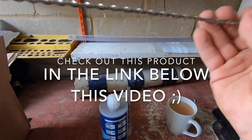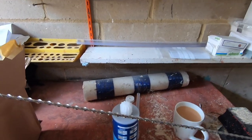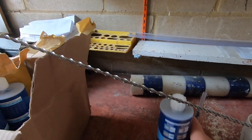The rods are flexible, which allows you to go around corners and work into any mortar joint. Where I've got the joint it's staggered and cracked a bit, which is where this is useful. The idea is we're going to rake out the joints, pump some resin in, and then fix the bars into place. When the resin and the bars set together, that's where your strength is. We're going to need a grinder, a mask, and goggles. Let's get out there and do it.